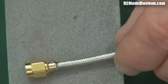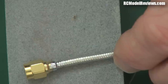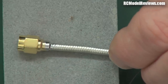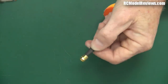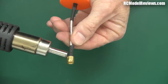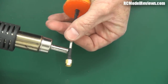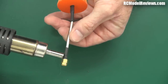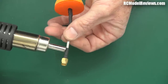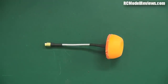If there are any little spikes you can cut them off with a knife or push them down with the soldering iron. Now just move the heat shrink up and shrink it into place. I use my little hot air reflow station — a wonderful little tool I never run out of uses for. Heat the heat shrink up and it pulls down nicely, giving a very professional-looking job. That's it — done! The connector is attached to the homemade cloverleaf antenna and RG402 semi-rigid coax. Simple as that — a piece of cake.